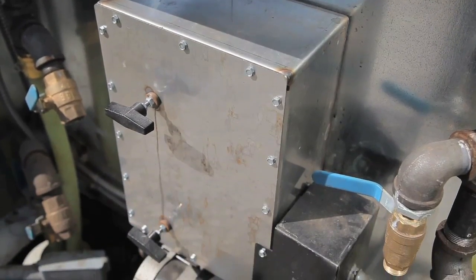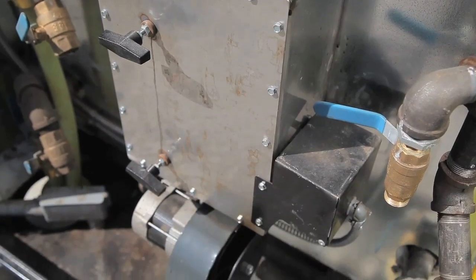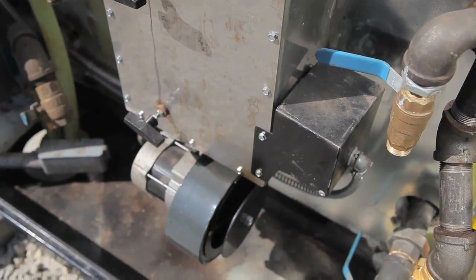There's a small electric fan motor in there. It's got ball bearings, not bushings, and those bearings are sealed to protect them against dirt, to make them as reliable as possible. There's also 2 air dampers that close when the fan stops blowing air into the firebox. A small electric motor that controls these dampers is widely available should you ever need to get a replacement.